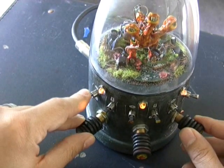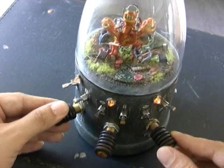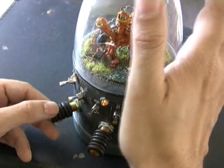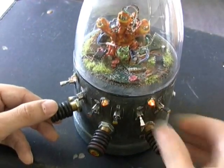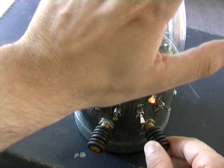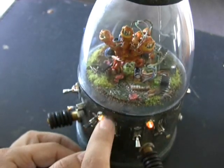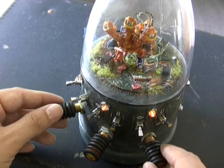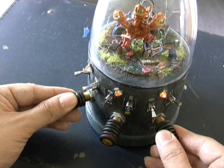I'm going to turn this one to potentiometer mode. So now the core frequency oscillator is controlled by the pot, while the others are still on photo transistor. This one connected to pin four is still on photo transistor. If you tune these two capacitors to very close to the same frequency, it kind of starts to pulse.